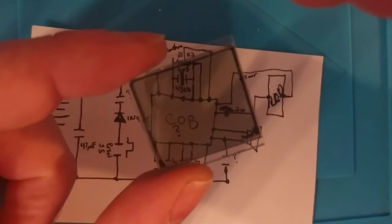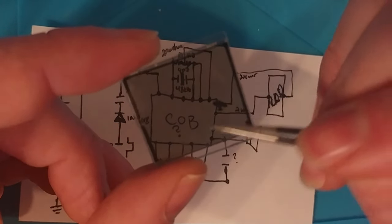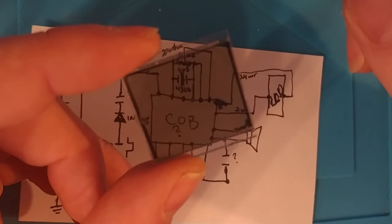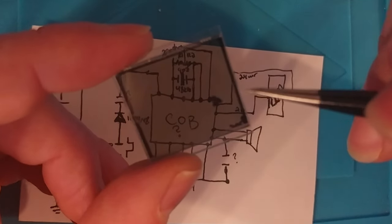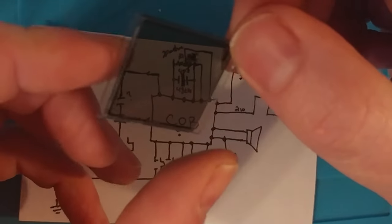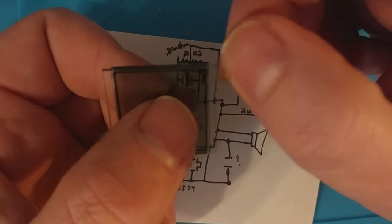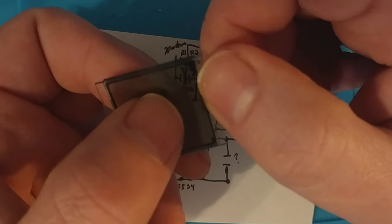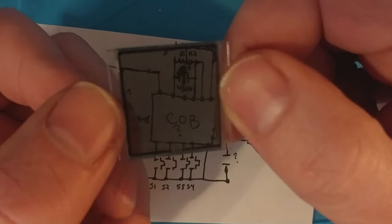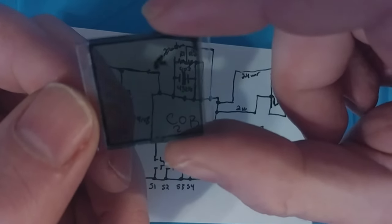Now what I'm about to show you isn't really a fix. It's still a bad LCD. It's just trying to get this bleed out of the way of the screen. Now some of it might settle back into wherever it should be. But there's a method for getting rid of the bleed, and it's by applying equal pressure, bottom, with your finger, and top, like a pinching pressure, and massaging the screen to get the bleed over into one corner, okay? Now I could potentially crack this glass and ruin this LCD further, which I don't want to do.